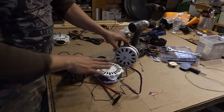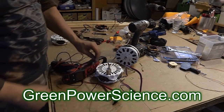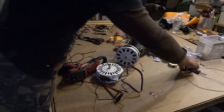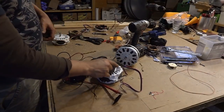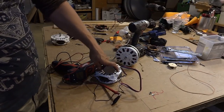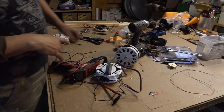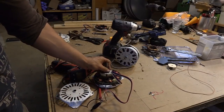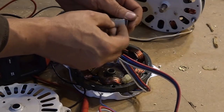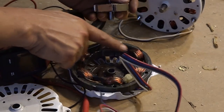These are all on our website GreenPowerScience.com. These magnets are sometimes listed on our website; sometimes we just tell you to go to Magnets for Less. But this is the secret to the deal — it is a two-inch hex piece of bar cut. We sell them if you can find somebody. The other way to make it more powerful is to double up the magnets where you put an extra magnet on each face to increase the strength and bring it closer to the coils.